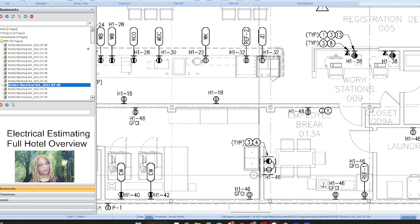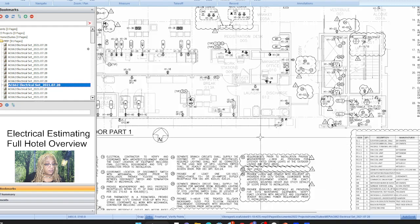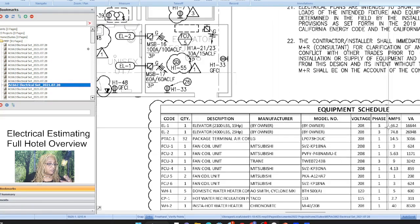You're going to look for all of your different types of outlets; some are GFCI, some are not. Now, what you're going to look for too, if there is a kitchen, like here we go. This is the equipment, and I'm thinking kitchen equipment because those outlets are different. You want to be looking out for those, because depending on how they format the plans, the kitchen outlets are some weird NEMA numbers. There are so many different kinds. They may not give you that specific NEMA in the picture version, but they'll tell you what piece of equipment it is connected to.